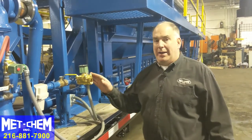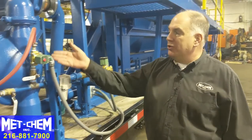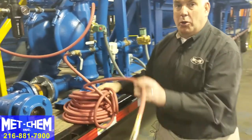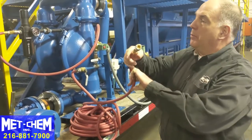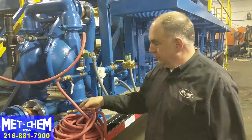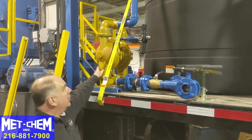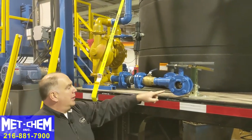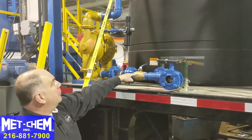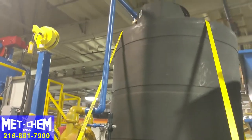This is the main air inlet — it tees off for the air blowdown as well as operation of the diaphragm pump. A removable hose goes to the auxiliary pump, which can fill or drain this tank. The auxiliary pump is mounted near the front of the trailer next to the tank. You can connect to the tank at ground level and feed or drain from the bottom as well as the top. By flipping the appropriate valves, you can pump either way.